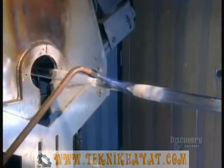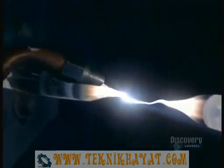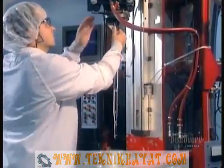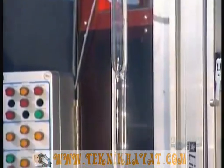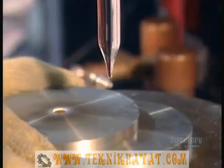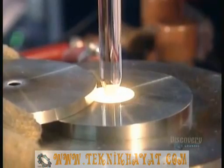The internal structure of the optical fiber has been achieved, but it's in the form of a big, bulky rod called a preform, so the next step is to thin it out. First, they excise the preform from the uncollapsed section of the glass tube. Then they install it vertically into the drawing tower, which will draw out the final shape.